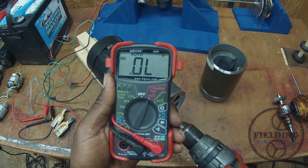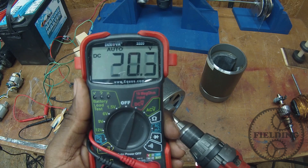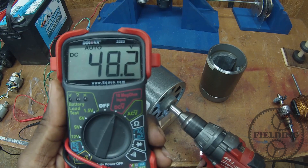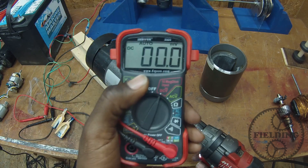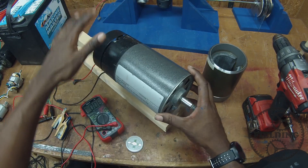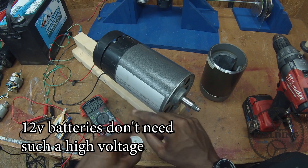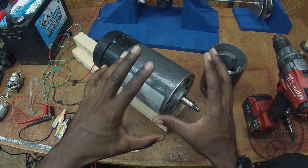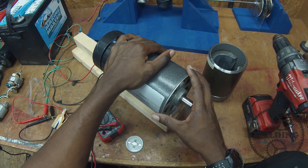I'm going to switch the direction so that we get a positive voltage. I can get about 48 volts. So if I spin this up to its rated speed of 4,800 RPM, I would get about 130 volts DC out of this motor. If you wanted to power household appliances here in the US — typically 120 volts — you're going to need to invert that to AC, alternating current. We'll talk more about AC in the next video.